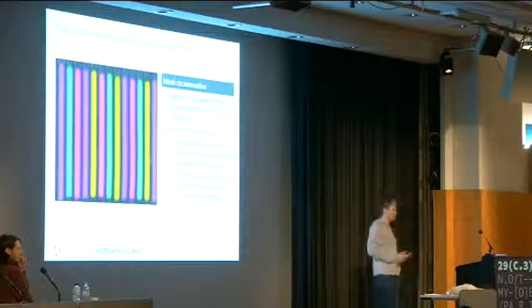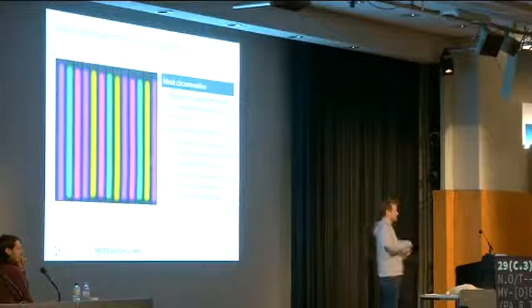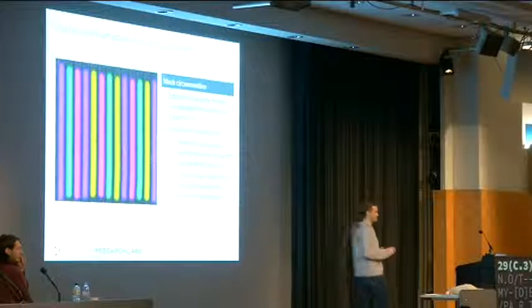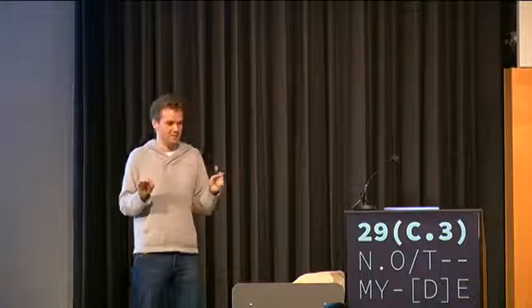Up the sleeve of current and future smart cards are things like analog meshes, where the simple attack of connecting different lines that belong together is defeated through supplying an analog signal and then actually measuring the antenna capabilities of these lines. And that, of course, is changed through the edits. Other things that are already found in at least one smart card is redundant distribution of data, where you'd have to intercept the data in different places at the same time, basically defeat two different cores with the same attack at the same time, and those cores kind of help each other stay secure.